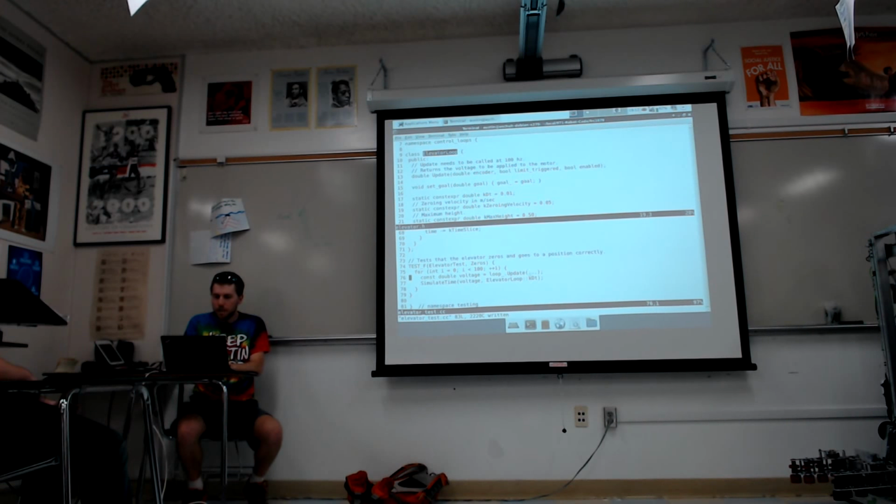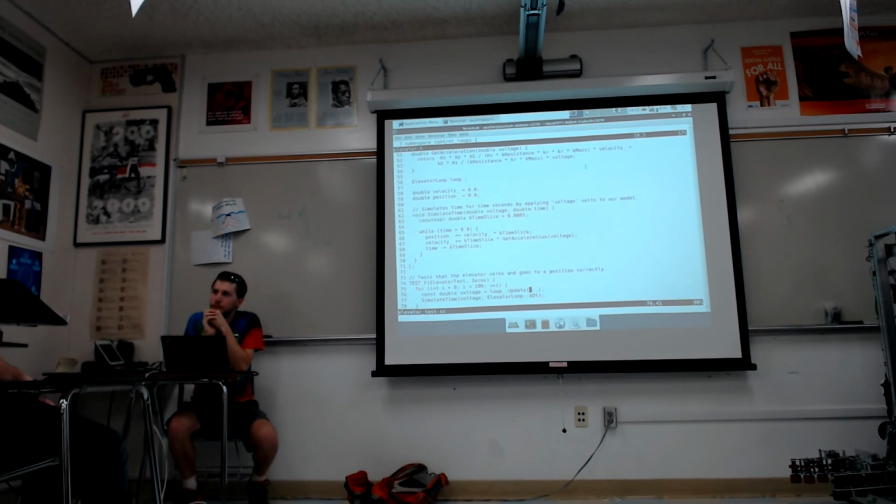Okay, except our update function, which I didn't fully fill in, takes an encoder, a limit sensor triggered, and an enable bit. We have to make those signals up. So just take the position that the robot's at from the simulation and make that the position for the reads. Is that fully accurate with an encoder? Where's 0 on an encoder? Well, it's relative. Wherever you turn it on.